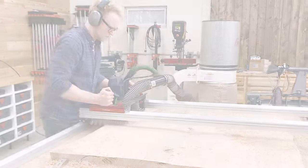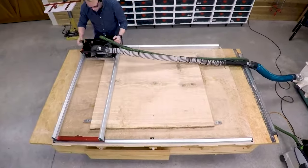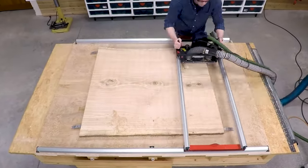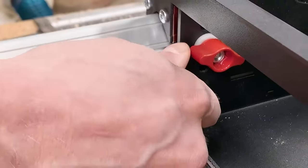This process produces lots of shavings. The new optional dust collection port bolts to the carriage and rides along right beside the exit point of the shavings. It works with either shop vacuums or large dust collectors. A brush surrounds the pickup area, trapping the shavings equally well on smooth or uneven slab surfaces. It mounts to the carriage with 6 simple screws, replacing the carriage end stops.